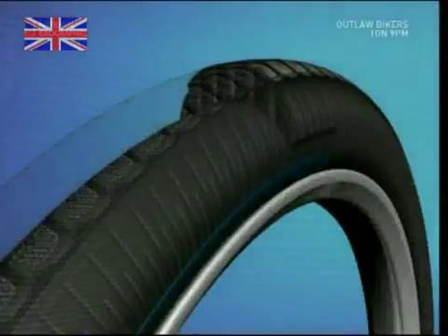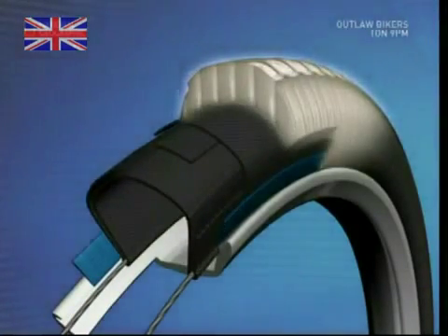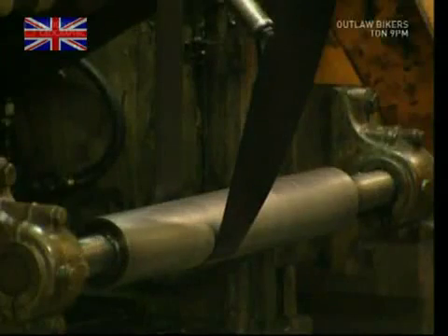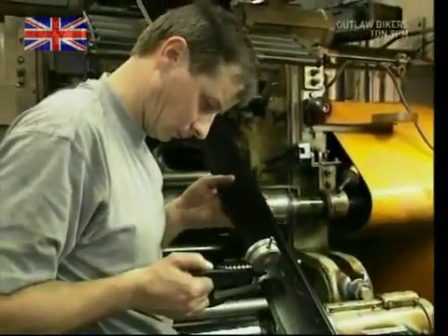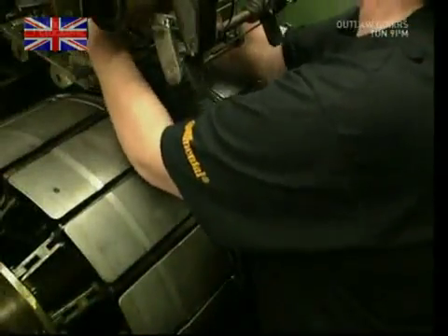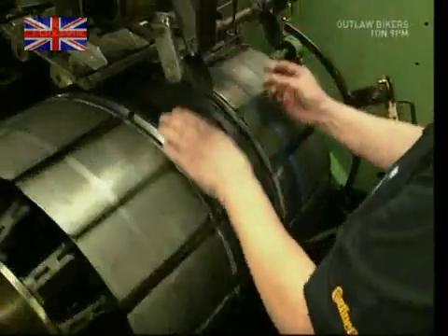And that's the tire's structure. But if you tried to ride a bike on a tire like this, it wouldn't be very comfortable or give you much grip. The grip comes from the tread, made from a combination of two layers of hard-wearing rubber. An expert continually measures the width of the two layers, otherwise the composition wouldn't be right and your tire wouldn't grip. The raw tread is sent off to be added to the tire carcass — a layer is wrapped around the drum and firmly stuck down.